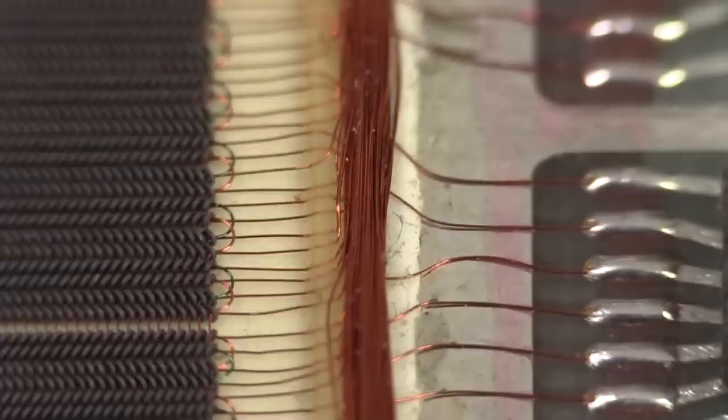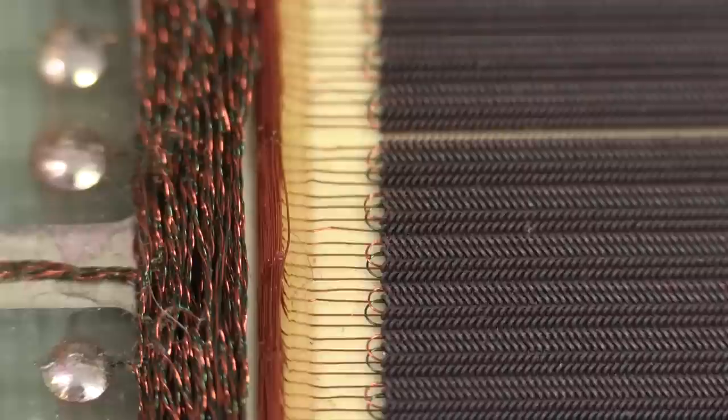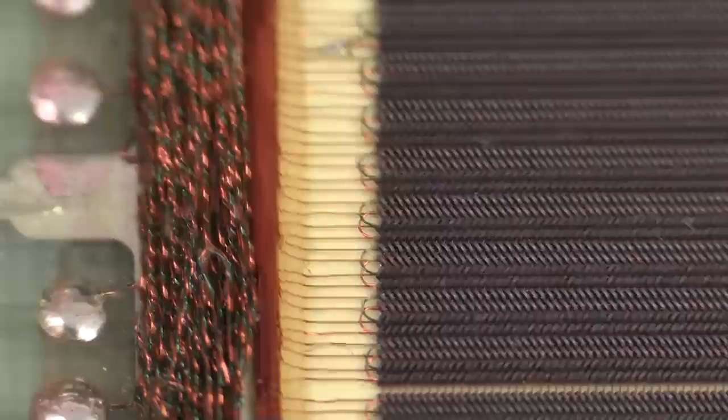They just branch off like that as we go down. It just gets thinner, thinner, thinner until, well, there's a few branching out like that. And we couldn't fit that on the board, so we're just branching these off down here. It's insane. And then you've just got the bundles of multicolored enamel-coated wire doing the rows and columns in there, and of course the sense line and the inhibit line. I don't even want to know how they manufacture this thing. Well, actually I do, because it'd be totally fascinating, but this is rocket science.